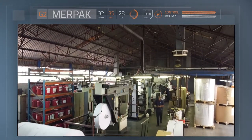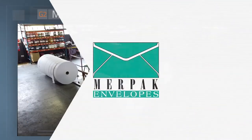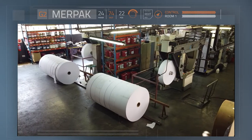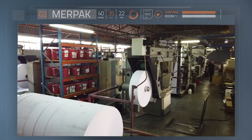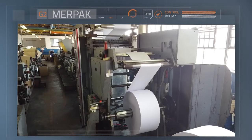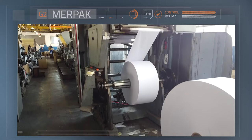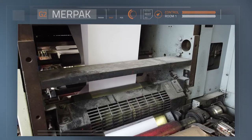The factory has a number of different sections and machines. Paper reels feed the paper into the machine. The reels used can handle paper from 185 millimeters to 515 millimeters in width, and the machines can handle paper from 70 grams all the way up to 180 grams in weight.